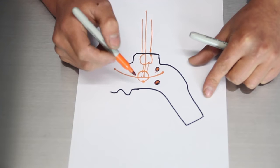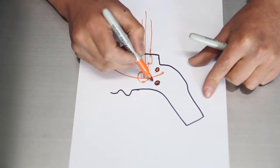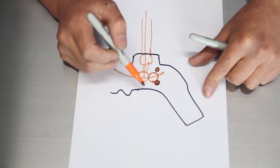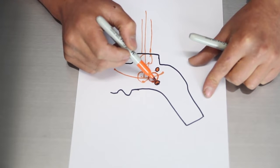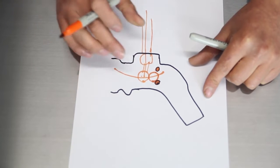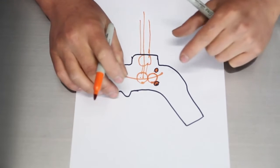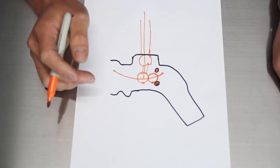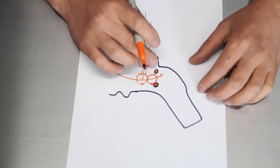So what happens is, let's say the tap shuts just gently, and you just sort of gently close it, the ball will sit a little bit like that, and it will press the lower O-ring a little bit harder. So you get a little bit more O-ring compression on the lower O-ring and a little bit less on the higher O-ring. And then the O-ring itself has this floating O-ring design where it can move around. So as long as it's well lubricated and the tap's really clean, that O-ring can move into place and adjust the height for where the ball is.